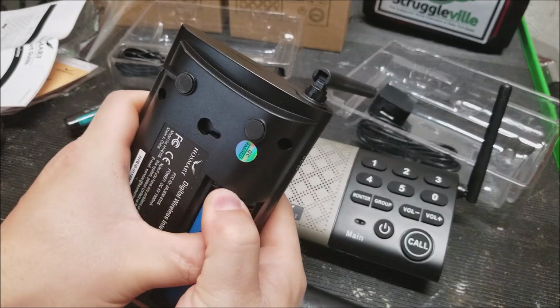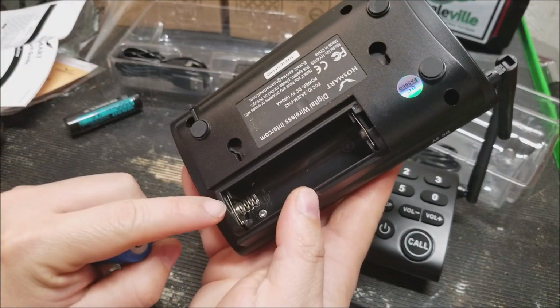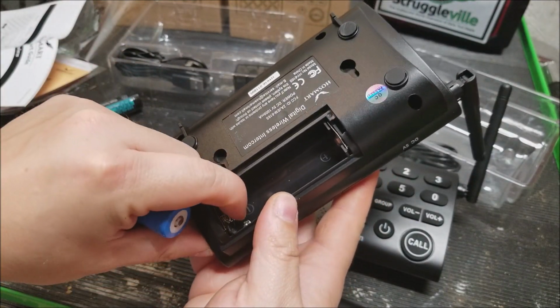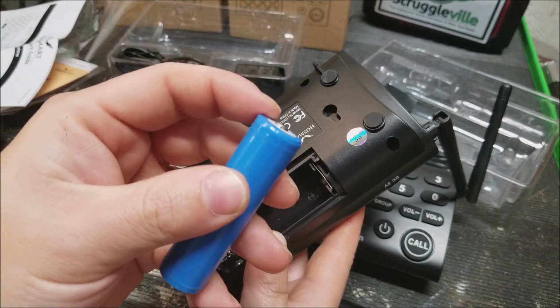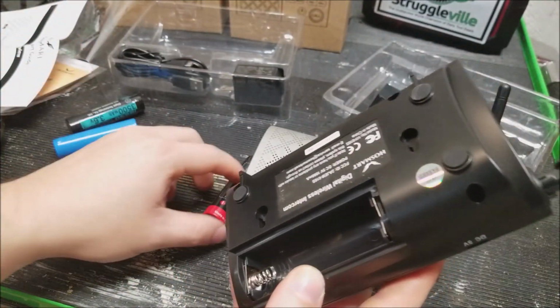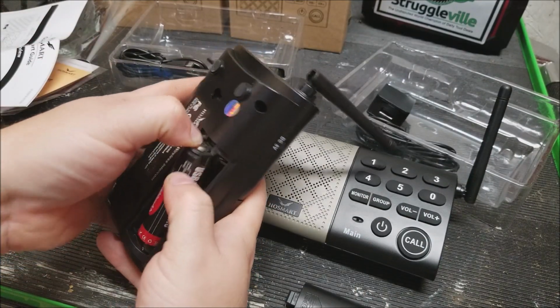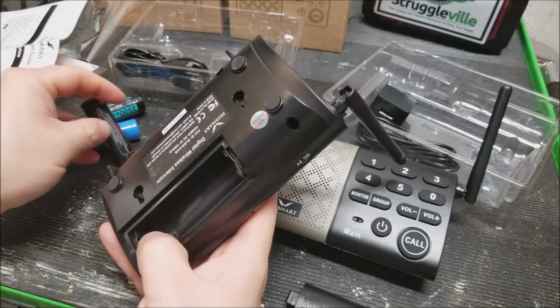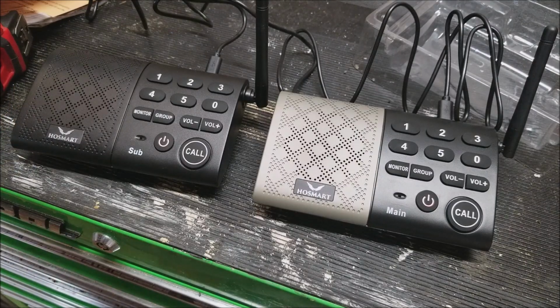now the really disappointing thing about this is look how much play there is in that spring. How much that spring can compress. And how much more room would we need just to fit that little button in there. Good for you to know if you buy one of these that you need a flat top. Ooh, that didn't sound healthy. You need the flat top. Obviously the button top 18650s are not going to work. You're going to need flat top 18650s.